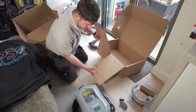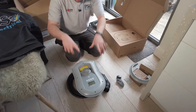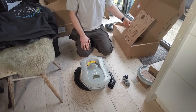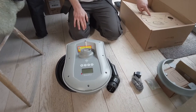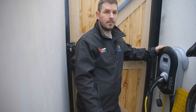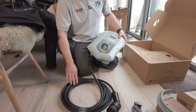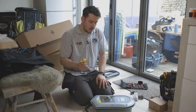This is where we have the main bulk of the unit. You basically take all the screws out and underneath there are fixing holes to mount this on the wall. The instructions tell us this one needs to be mounted at 1.2 to 1.4 meters high off the floor. We're thinking about mounting this down the side alleyway to give nice and easy access for the cars. It currently comes with a length of cable, but we don't believe it's going to be long enough to reach the front.